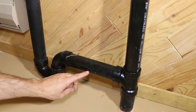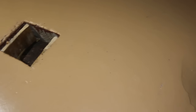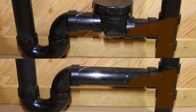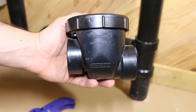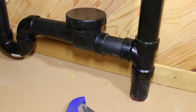Number thirty, not installing a backflow preventer in the basement. Your basement is most prone to flooding if the city's sewage system backs up. Every drain coming out of a slab is supposed to have a backflow preventer on it, which should be underground with access to the flapper. If the sewers were to back up without one, it would flood your basement with waste. You can get one at your local hardware store and install it yourself — just make sure you have access to it at all times in case the flapper comes off.